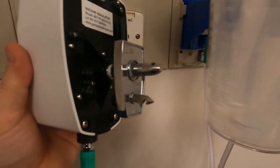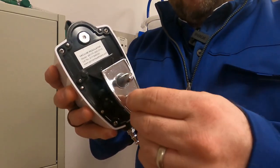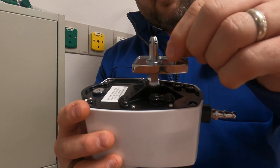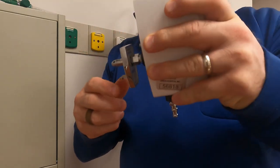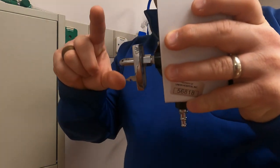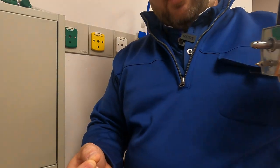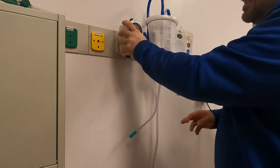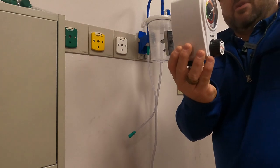Med vac is where this is going to go. Let's look at the back of this - this is the regulator attachment. You're going to see this area right here, this is where the vacuum is going to pull from. This piece right here - in this case it's a little bit loose, that's a common problem - is what's going to latch it into the wall so it won't come out. It goes in similar to a flow meter, locks in place, and there's a button on top in the back that allows you to remove it from the wall.